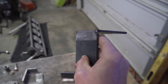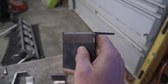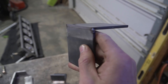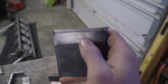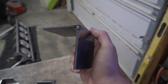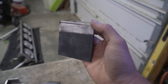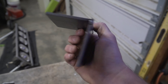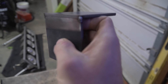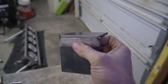I have a couple things cut out and set up. The first is the most common joint I see on YouTube - people just butt things up together like this, tack it in, and burn it together. The issue with this setup is you're not leaving any room for penetration, so you'll have to turn your welder up really hot to get it to burn in, which will potentially warp whatever you're making.